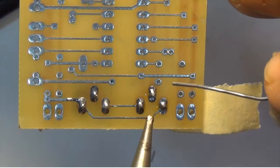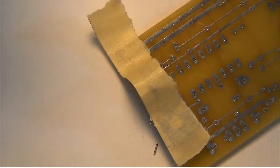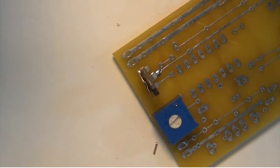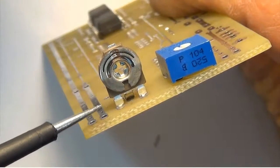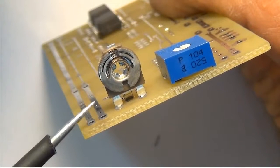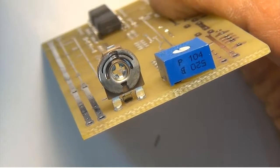We missed a little bit here, so we'll just touch it up. We'll put our soldering iron in the holder and take a look at the other side. Let's remove the masking tape — it looks pretty straight. This side looks pretty good; I don't have solder running up the leads. I have seen students put so much solder in that they've actually joined one of the outer leads to the wiper disc connected to the middle terminal of the resistor trimmer — and this happens because this is a plated-through board.